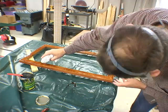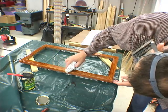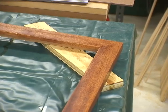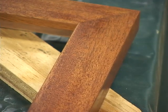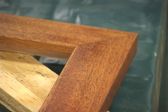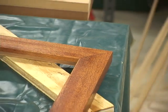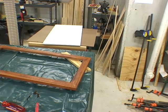I know it says you only need maybe three or four coats to build up. This way, you flood it and then wipe it and flood it and wipe it like three or four times. But I wasn't happy with the consistency I was getting, so I ended up doing some very fine coats between. And it took me somewhere around 8 to 11 coats to get it to, here's the dried first coat. Later at the end here, I'll show you what it looks like with 8 to 11 coats. I can't even remember how many. There were so many coats I did. I put them on real fine, almost like a French polish technique in a way. It was just padded very thin, let it dry. I could only get about 2 coats a day that way.